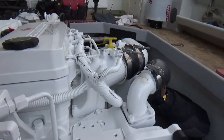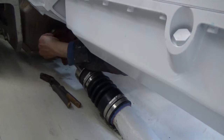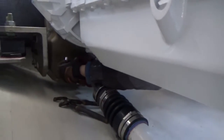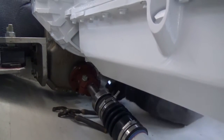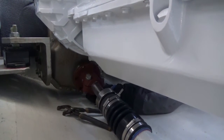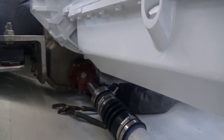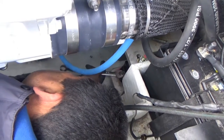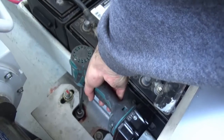Putting a little pressure on it and hitting it lightly to move it. Then turning the shaft 180 degrees and checking again — if it changes you've got an issue with the coupler. It's good. Checking the bottom — we're at four thousandths of an inch. Now we can drill these back stringer brackets.